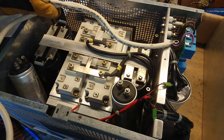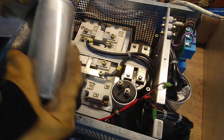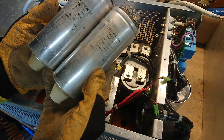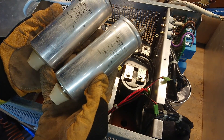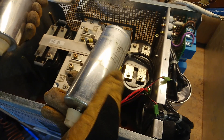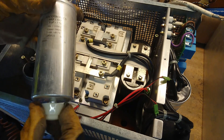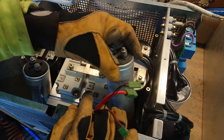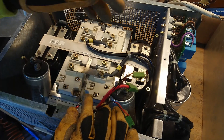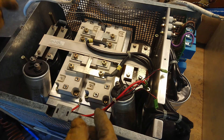Before going out to the x-ray head, the wires sit in series with two film capacitors — these Accotronix MKP, 8 microfarad. This is because the tank itself is driven as an LC circuit, but it's driven out of resonance. The way you adjust the power level or voltage output is to adjust the frequency at which this bridge is driven — you drive the x-ray transformer more or less up against its resonant frequency, and by that you get a higher output.